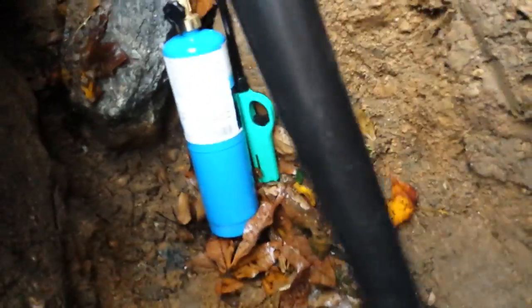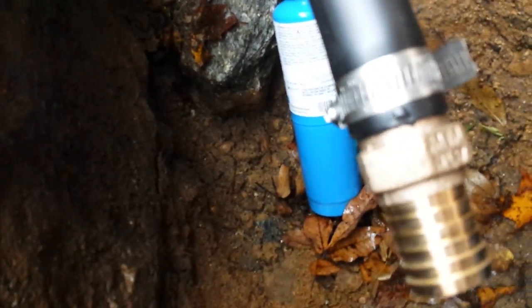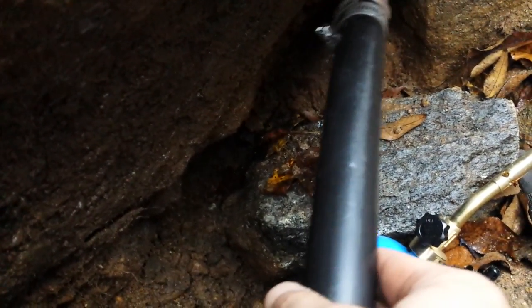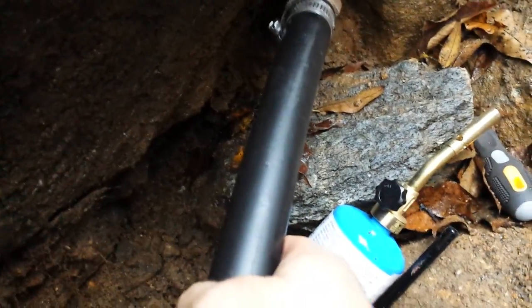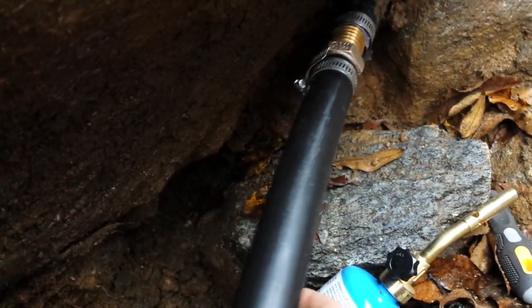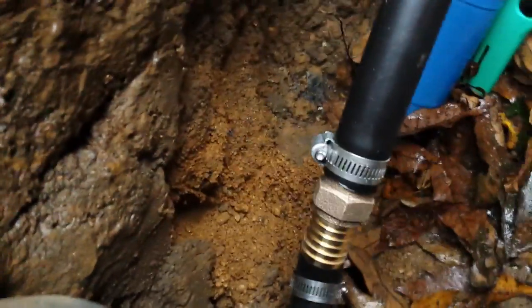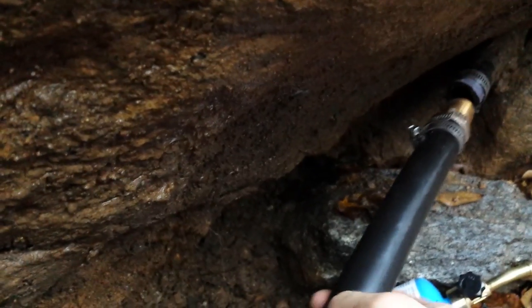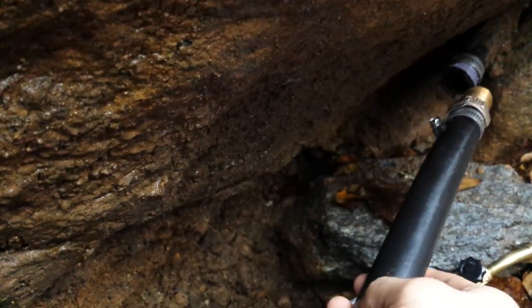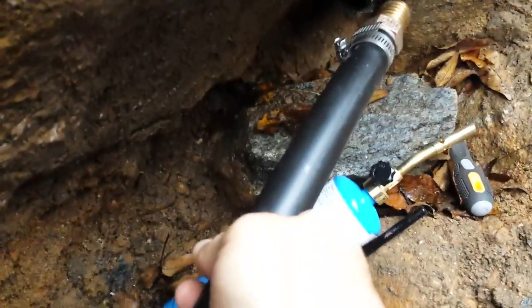That's how you do it — both ends, same thing. What I'm going to do now: I'm not going to show the rest because I have to work on this — it's raining outside from what's left of Hurricane Nate. I'll heat the inside for a few seconds, outside for a few seconds, pop this in, clamp it down, and wait a few minutes until it cools off and the plastic hardens up before attempting the other side. If you do the second side while it's still hot and pull on it, you'll put a hole or an indent in the pipe. Do this side first, heat it till it softens, pop it in, tighten it up.